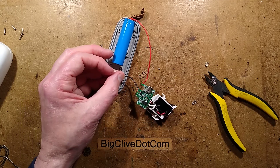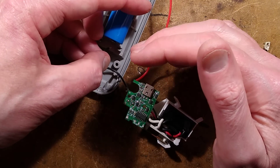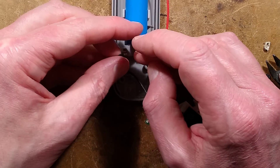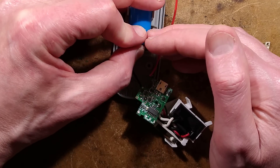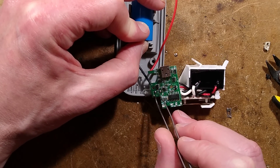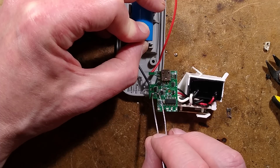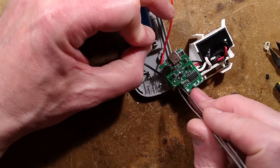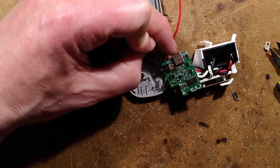If I power this up now, you'll see it go through a little LED self-test routine. I'll zoom down so you can see it. Initially when you power it up it does its little LED test and then stays off. So removing that switch has cleared the problem. Now if I short those pads out with a pair of tweezers — well, if I can manage it with my fumbly hands — let me try to get through the flux.